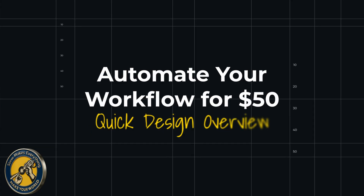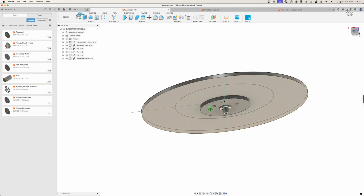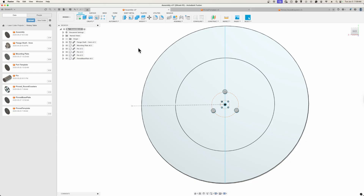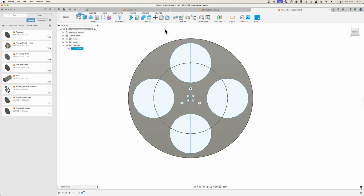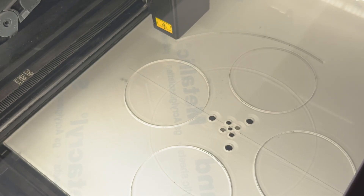I'll show you what I designed — I won't go into deep detail on how I designed it, but I will show you an assembly. The base plate is the main drive: it's a round table with three pins sticking up for positive placement of any jig plate. This is all attached to a flange that mounts directly on top of the stepper motor — direct drive, really easy. I also created a jig template file you can clone, drop your design on, rotate it around the center, and create your own jigs fairly quickly. For example, I made a coaster jig with a 100mm circle and got four round coasters on the outside.